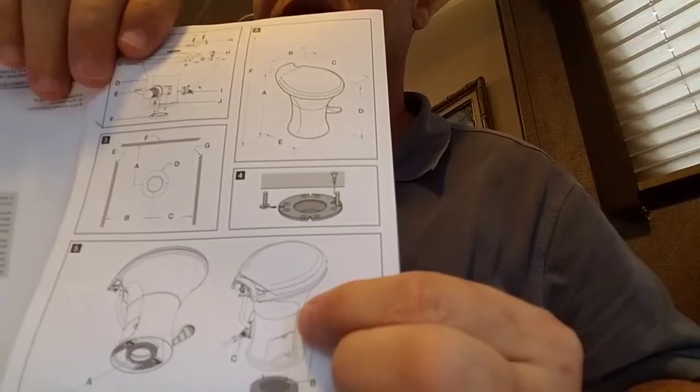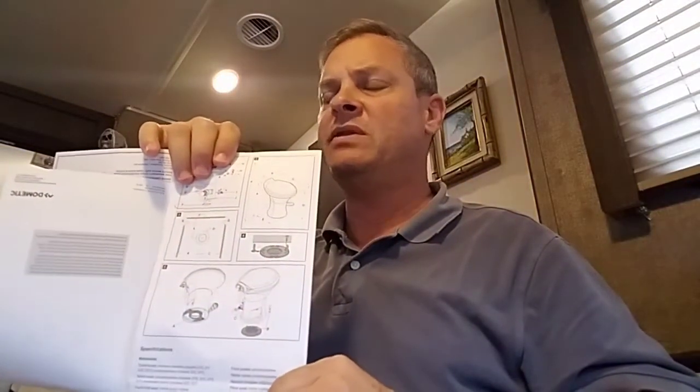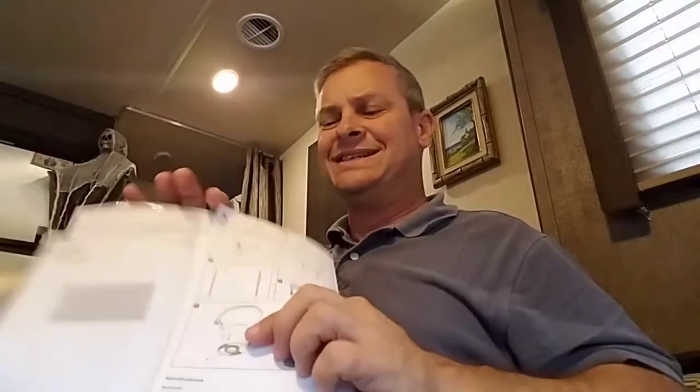In that middle joint area is the mechanical stuff — the flush valve, they call it a ball valve and ball seal, and other components where you push the pedal and the valve opens. I looked up inside and saw four screws, took a long screwdriver, opened it up, and found a rubber seal that seals the two pieces — the top piece to the bottom piece. I was able to follow where the drip was coming from.